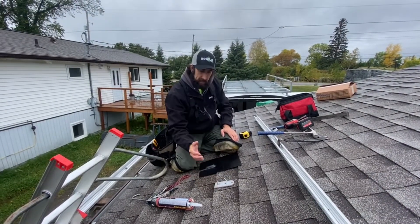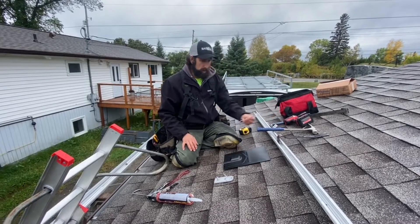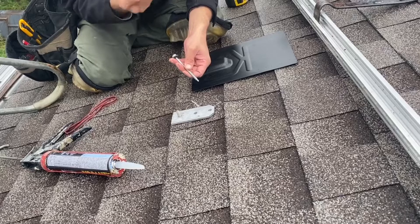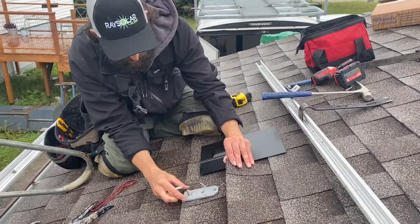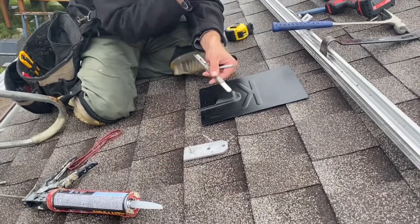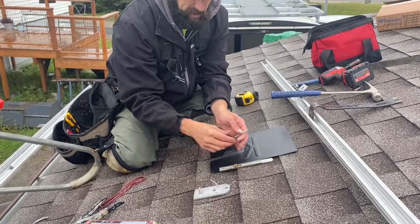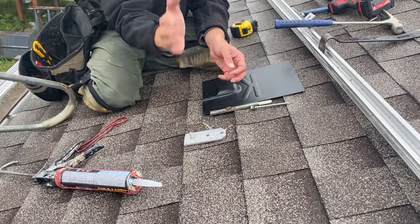Now let's talk about actually mounting the structural part of the flashing into the roof, then sliding in the actual aluminum flashing piece. We've got some self-tapping screws going in. It's really important that this goes straight into the meat of the rafter — we don't want to catch the edges, we want a good bite and structural adherence. We've got our reference mark, and I was talking earlier about using the edge of your shingles as a reference. These are perfectly straight and I'm actually going to use them as a reference mark as we go.